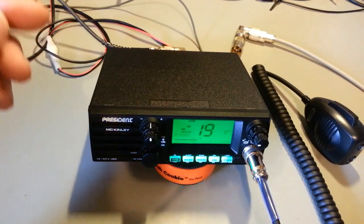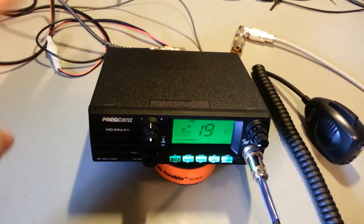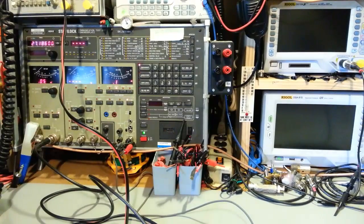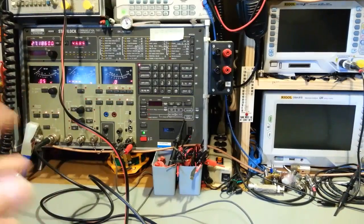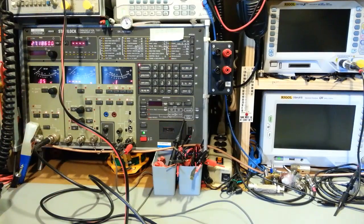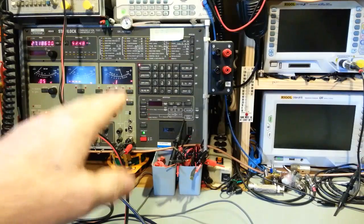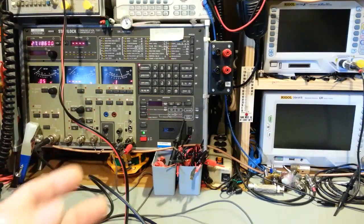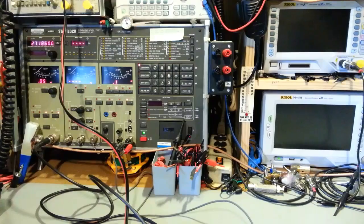They're very good specs. But quite honestly, a lot of times that's the problem, quantitative measurements with even a big fancy piece of test equipment like that sometimes don't translate really well into the real world. Now, I use SINAD measurements because they do translate into reality really well. The reason being, it also accounts for distortion. But a lot of times the image rejection and adjacent channel rejection measurements you take with an instrument may measure fine, but in the real world it doesn't quite mean as much to me.